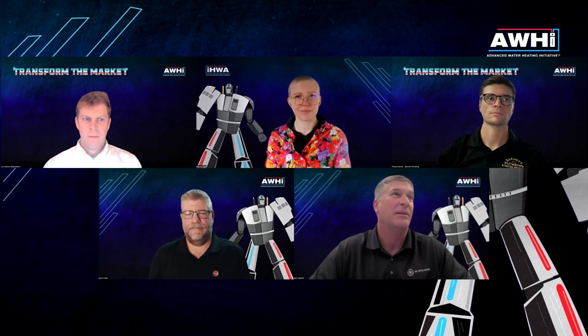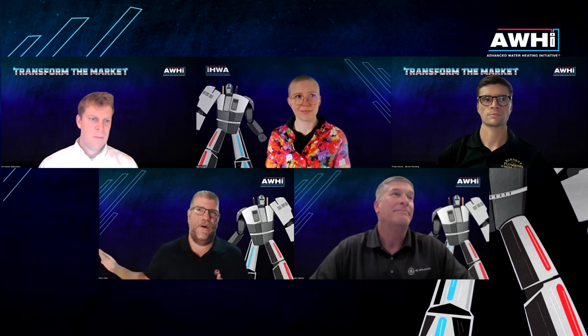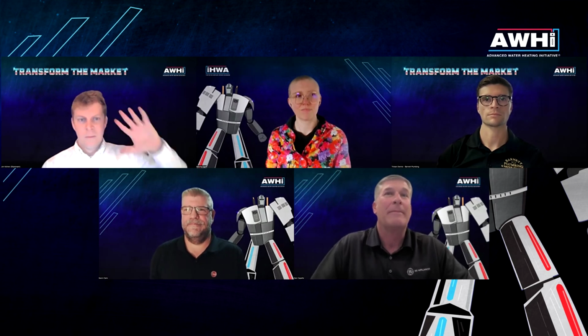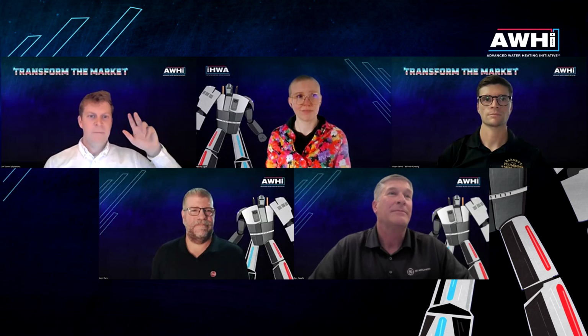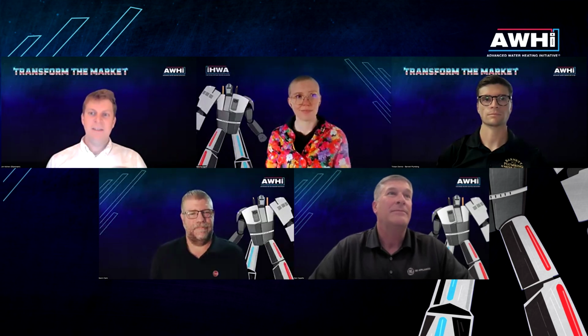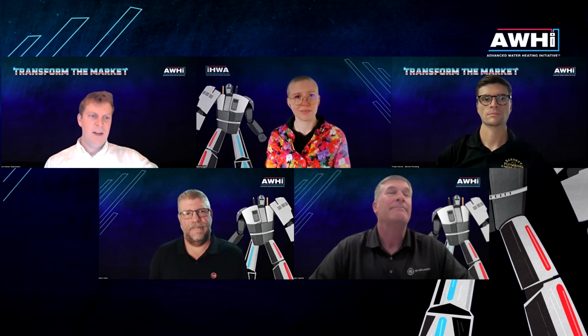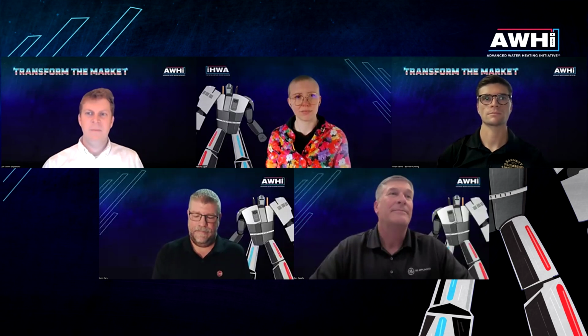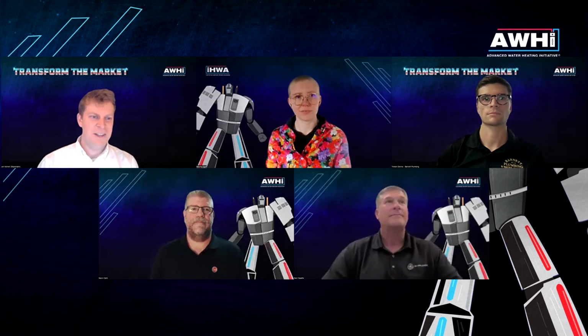Kevin, anything to add from your side? No, pretty similar. I think we put a 9 or 10 foot cord on, so if you look at a garage, which is usually 10 by 20, normally we're within reach of a plug if there's a plug there. And I would just note, in that circuit extension discussion, it is easier to take an existing 120 volt circuit with an outlet and extend that than it is, for a shared circuit model, to run a circuit entirely from the panel in many cases. So there is still some benefit, but if you can't solve the cord issue, you can't solve the cord issue.